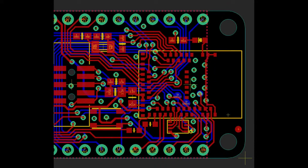Here's an example layout. With the Circuit Playground Bluefruit you can kind of barely get away — if you do that hack, I got away with a two-layer board but had to go down to 5-5 mil rule. With the module you can stick to 7 or 8 mil space and trace, which is definitely within the budget of any project or PCB house. You don't have to go 4-layer, you don't have to do any funky via stuff. All the traces come out nicely and grouped in a logical way — at the bottom there's the QSPI flash, and all those pins are right next to each other.